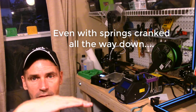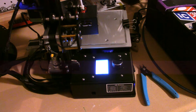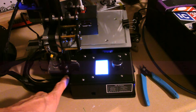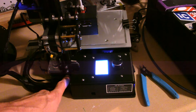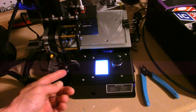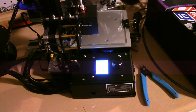And that's what I've been using. When I first put it on, there was an issue. Because that glass is so thick, I could not get it to level correctly because the build surface was sitting too high and the end stop would not engage. So what I had to do to fix that — normally this is the bracket for the Z-axis end stop, and normally there are three bolts here — I had to remove the bottom one because that has a stationary hole. The top two are T-nuts that slide in the rail. So I took out the bottom one, slid it up just a little bit, and through trial and error I tightened it up and got it to a point where I was able to comfortably level the bed with the Z-stop slightly higher.